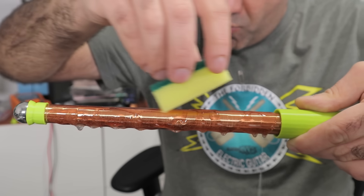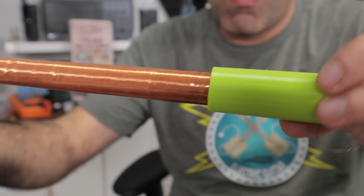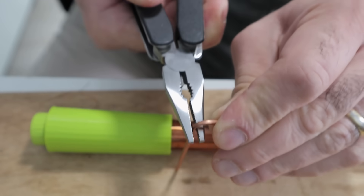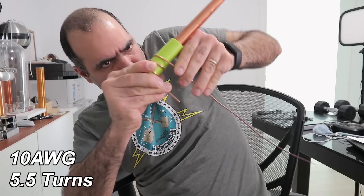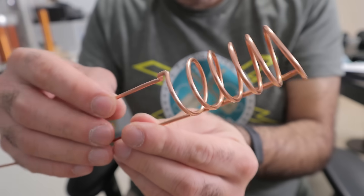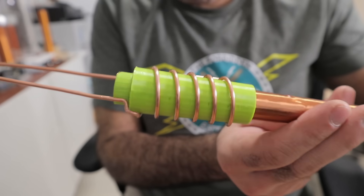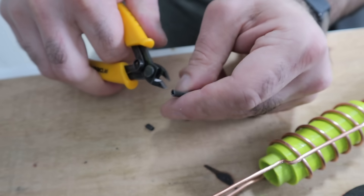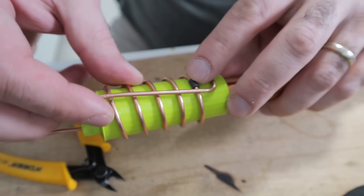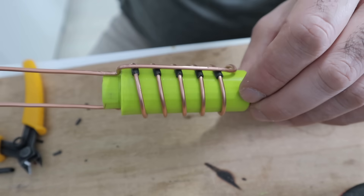The table is getting a free coating of epoxy too. Then I'll rotate it for hours until it dries evenly. Now we are making the primary winding, bending it into shape using 10-gauge wire. I bend and form — I didn't come all the way from Iran to state the obvious. I put it in place, then use the wire jackets to create insulation for the primary so that its wires don't touch each other. I think that was smart.